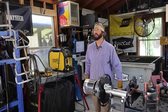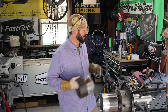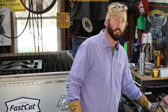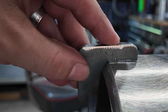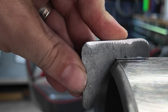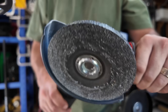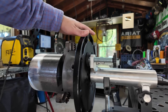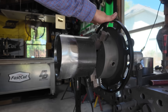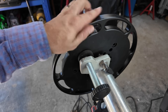Now we have two equal-size coupons and we're going to start beveling. We're aiming for about 35 degrees of a single bevel. I cut out this little piece off my plasma table that gives me a go/no-go gauge for holding 35 degrees. We're going to start by using a quarter-inch grinding disc. You need something to hold your coupon in place — whether you use a vise, a fixture table, or some clamps on a regular table.